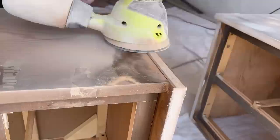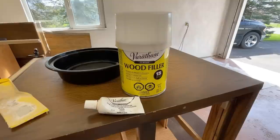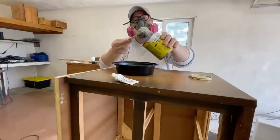My cuts were definitely not precise — I am not good with the power saws — but I was able to grind any excess down flat with my orbital sander and some 80 grit sandpaper. Next, because these are particle board and I now have a bunch of that exposed, I mixed up some heavy-duty two-part wood filler so that I could fill in that particle board texture.